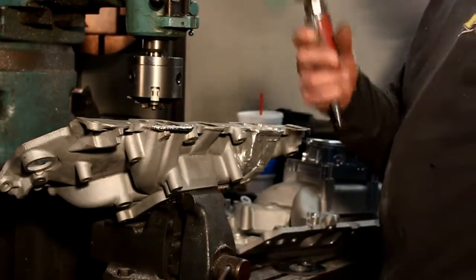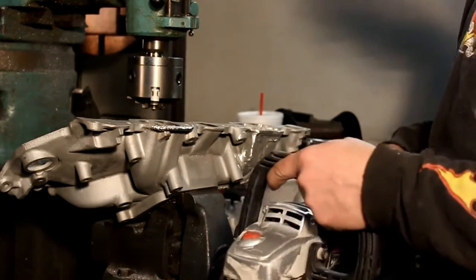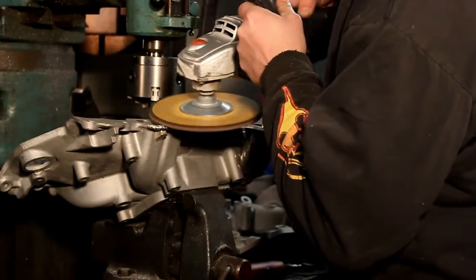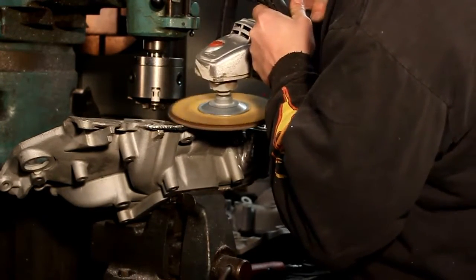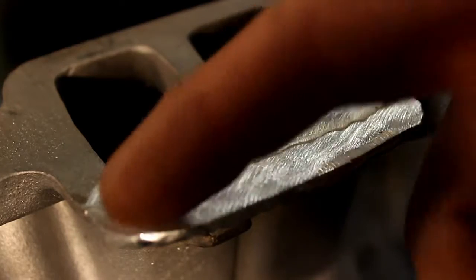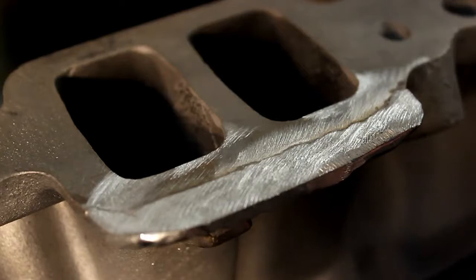I said I was going to use this, but I changed my mind. I'm going to rough it in with this because it's bigger and flatter. I'm going to stop here - I haven't ground it down flat yet - so that when I weld it back together, if it warps, I'll have some meat left here to grind it down.